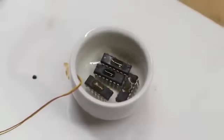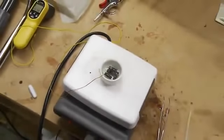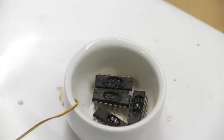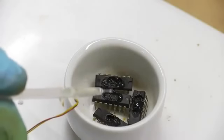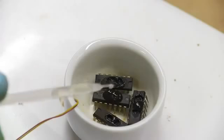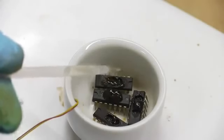I got it up to maybe around 100 degrees C. Some vague instructions I found on the web indicate maybe 140 degrees C even. The temperature seriously speeds up the reaction — so much that you can put just a very small amount of nitric acid in the pocket. You don't even have to fill it all the way. The heat causes it to bubble and froth and eventually it sort of dries out.